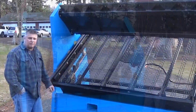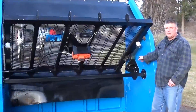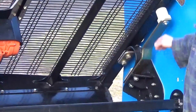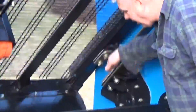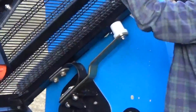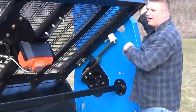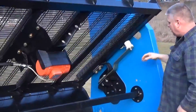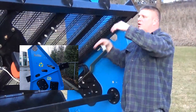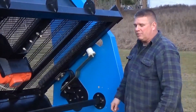Come around the back side — we still want to show you our new suspension. This is our new spring suspension for 2015 on our SLG 78 model. We've replaced the coil spring with a leaf spring, incorporated right into the same mounting system. So when this deck rocks back, you can have much more movement in this screener. This allows you not only to change the full slope of the screen deck, but you also still have your deck suspension that you can bring back another 10 degrees to manipulate the deck when you're screening.